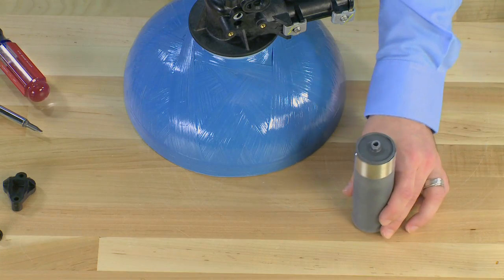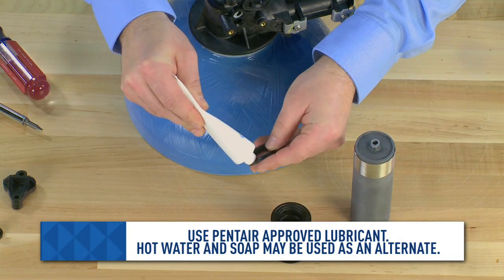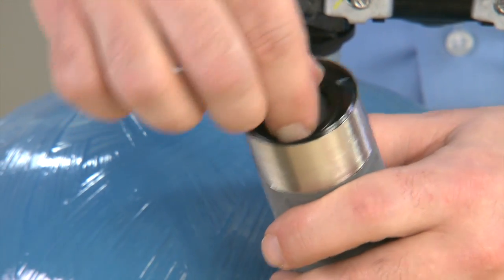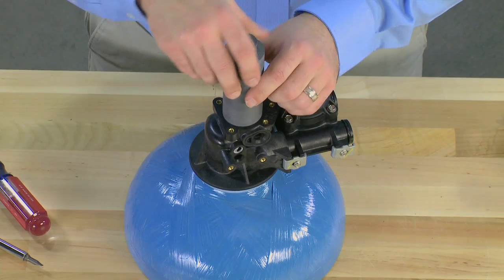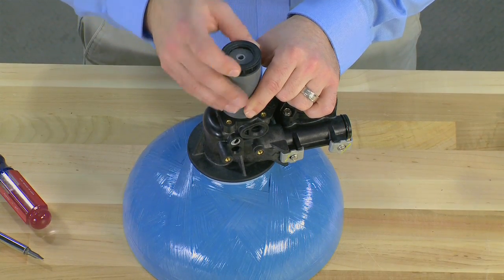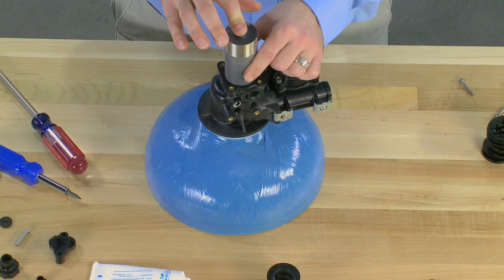To begin our reassembly, we gather the stuffer tool, a new set of seals and spacers, and the approved silicone lubricant. We lubricate all of the O-rings for the seals to make sure they are properly lubricated for the moving piston. The top end with the stainless steel — we press the seal into the top of it. Once pressed in, we move over to the valve body and press the seal down in, tapping the outside to make sure the seal is seated. We then put a spacer onto the end, flipping the tool over to align the spacer and make sure it is in the body nice and snug.